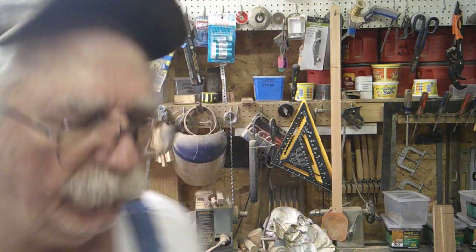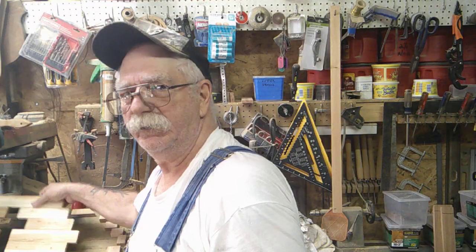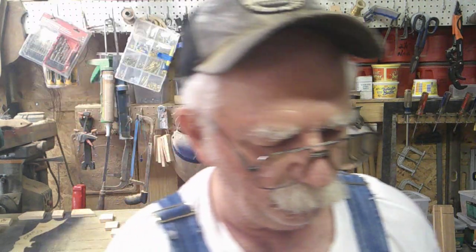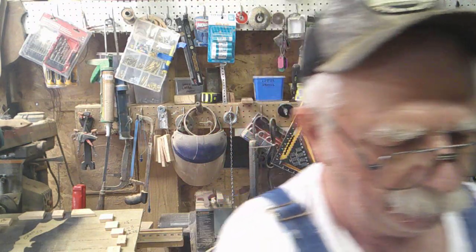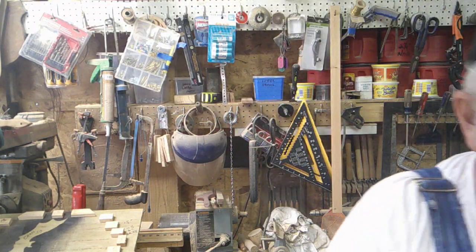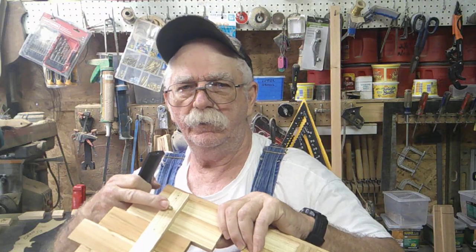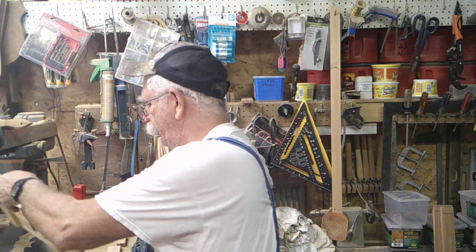And then for the strips on the back, let me get you a measurement for those since I didn't write it down. They're going to be pieces cut that are 1 inch wide and 9 3/4 inch long. You'll need 2 of those. Plus you'll need some eyes and some wire or different kind of device to hang your cross on the wall.